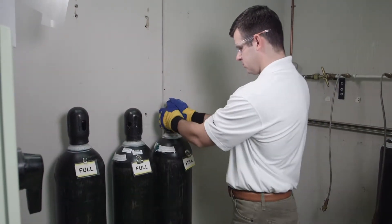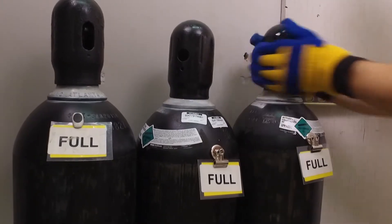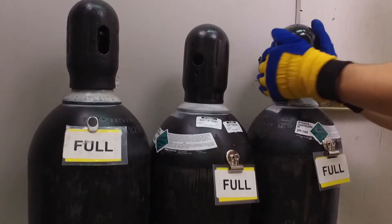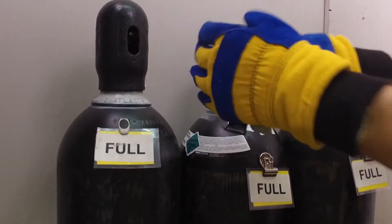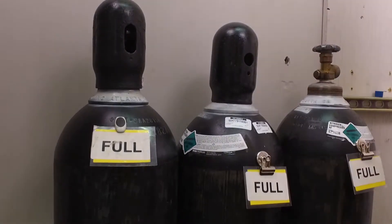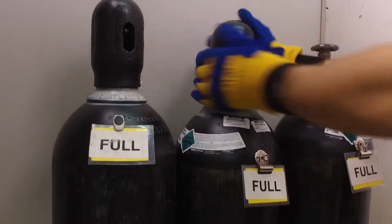Turning our attention to the replacement full cylinders, you may see that each full cylinder has a cap in place to protect its stem. Remove the cap from each of the replacement cylinders by rotating the cap counterclockwise to unscrew it and remove it from the cylinder neck. If a cap is stuck, use your adjustable wrench and insert the adjustable portion of the wrench into the hole located in the center of the cap. This should orient the wrench perpendicular to the cylinder cap with the handle sticking outward. Gently push the base of the wrench away from you — the leverage this provides will loosen the cap past its sticking point for easy removal.